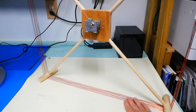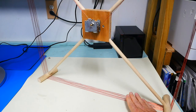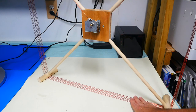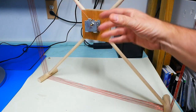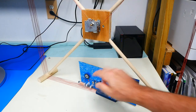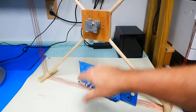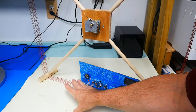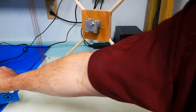When this antenna becomes resonant, and it's a very large antenna, so it's got a lot of area to pick signal up, it actually re-radiates its signal in the form of an electromagnetic wave. So we have a big antenna system catching the signal over a much larger area, and then it re-radiates the signal into our smaller antenna. So we have a big antenna sensitive to one frequency. At resonance, it re-radiates the signal and gets picked up by our smaller antenna. And of course, by tuning it, we can change the resonant frequency and where the signal is re-radiated.